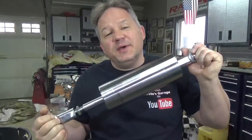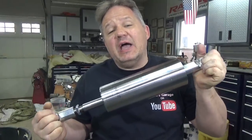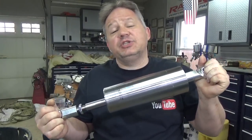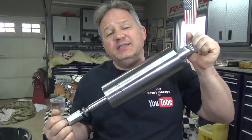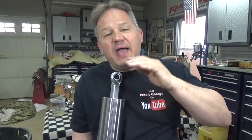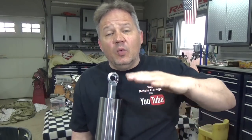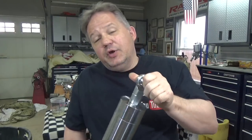Now these are the things I'm going to be painting — I have 4 of them. These are giant hydraulic buffers, just like a giant shock absorber. What they do is isolate vibration. These particular units are going on a piece of equipment that senses seismic activity. The device is actually planted 2 miles underground, and you have to isolate the pad that's sensing the vibration so that when it does sense something, it's true — you're not sensing vibration from like a train or something like that.